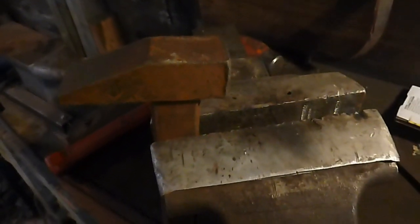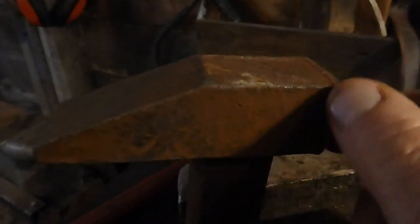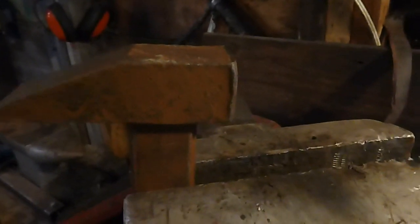I'm usually really careful to be as gentle as I can during restoration, but they've actually used the head of this wrench as a hammer, so it's really mushroomed. What I'll do is file that off real carefully, just until the mushrooming is gone, and make the corners like they were.